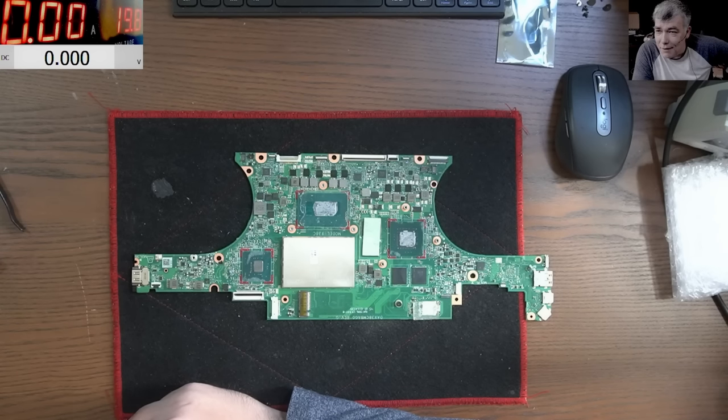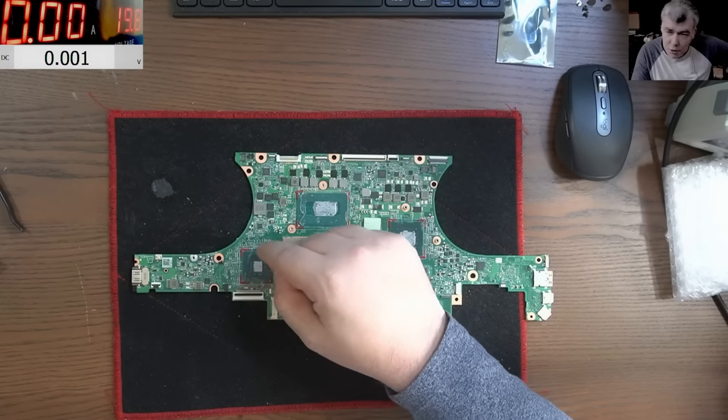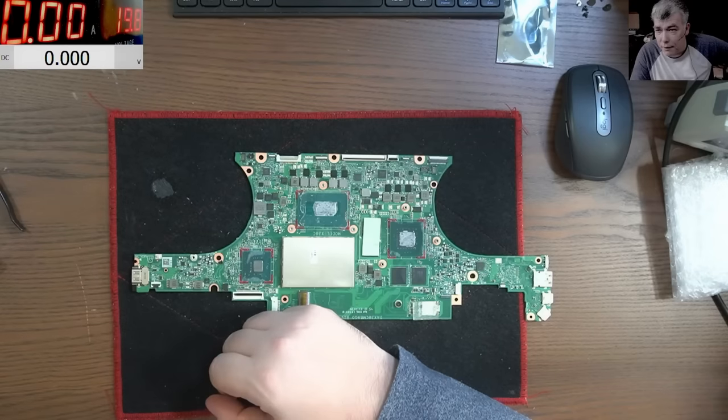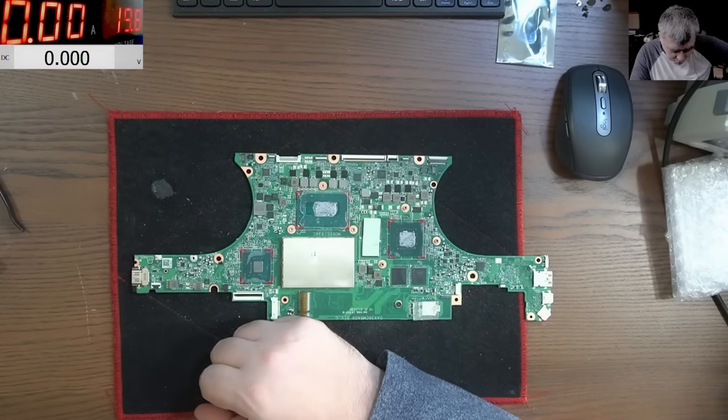But yeah, did I solder this kind of big chip before? Yes. With a normal soldering iron? Yes, I did. And I even soldered a chip, probably on this side, an NVIDIA chip, without reballing, and it was working. Of course, after that I tried again with 10 different NVIDIA chips and it didn't work. But you know, that's not the point. So it is a risky job, it is.